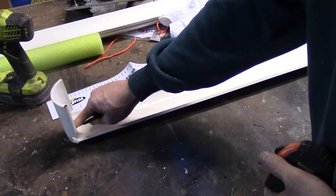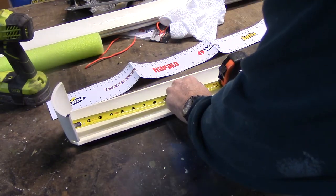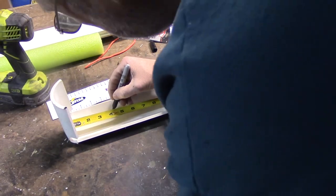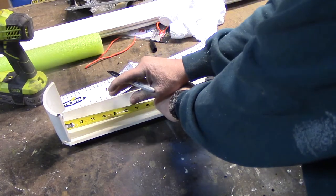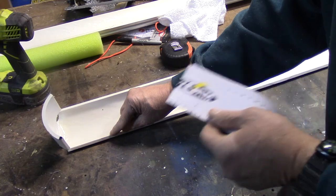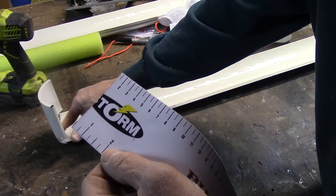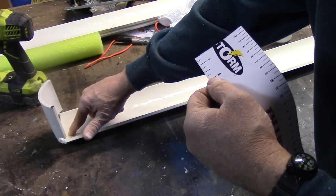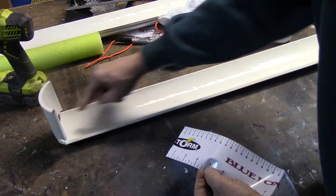Before I attempt to put the tape on, since this end is curved a little bit, I want to put the tape up about an inch and come to the back, placing a mark right at the 4-inch mark. I'll line the 4-inch up with the tape measure so I know it's where it should be on the trough. I went ahead and cut the tape so it starts at the half-inch mark — that way it'll eliminate any curves and start on the flatter part. I'll line it up with my 4-inch mark and then know it will be correct.